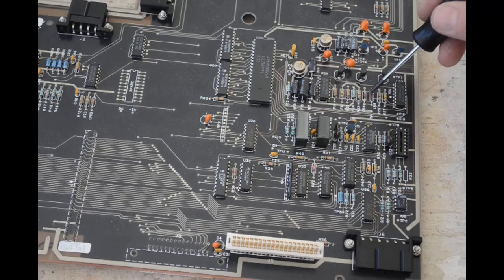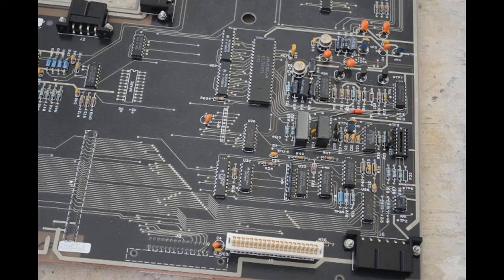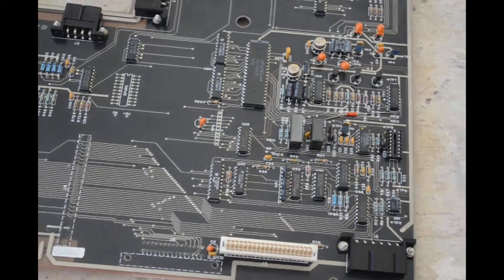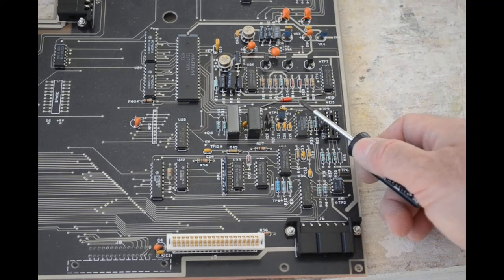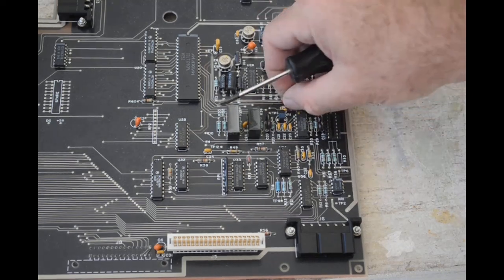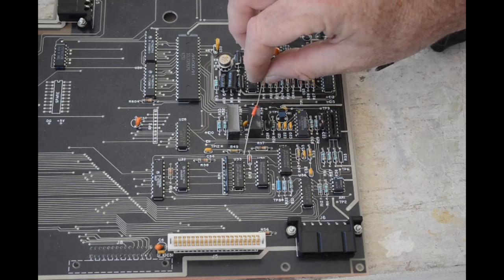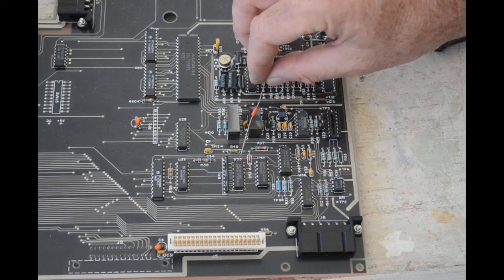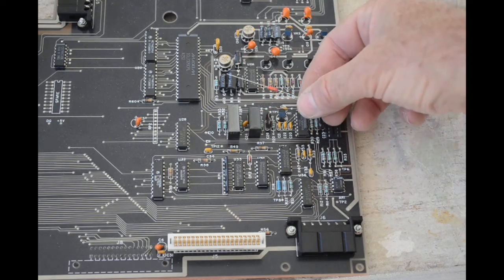I mentioned glass barrel diodes, and somebody's like, what are those? I've never heard of them. Well, they're basically diodes, and I had some here. There's a bigger example of one. I'll put it down here so you can see it. Basically, the body of the diode is just a glass tube that they put the works inside and seal up. You've got a lead coming out of either end, and inside you've got the tiny little silicon die or gallium arsenide die or whatever, and a little whisker of gold connecting one of the legs to the die. So that's a glass barrel diode. It's made of glass.